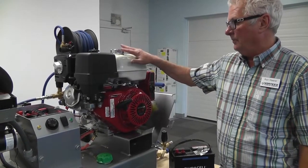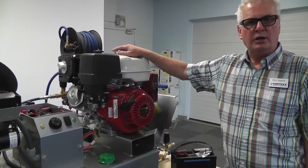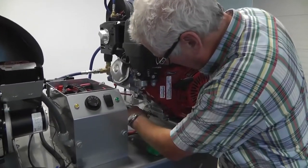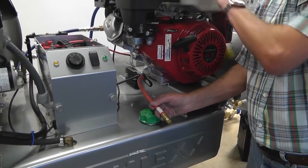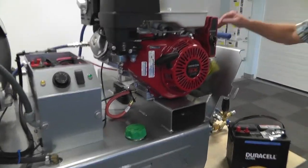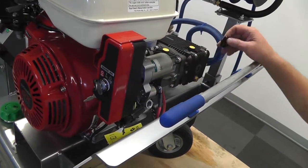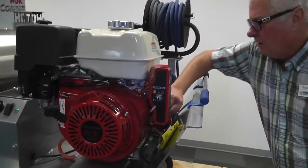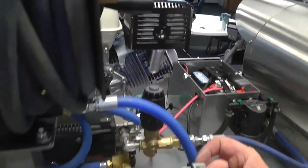My suggestion on the fuel — on the motor and pump — you should change the oil at 50 hours, and then I would change it once a year. I think it's two to five hundred hours per the manual, but you should change it at least once a year. We use OptiOil which will double your life if you want to extend it. We added an oil drain hose here that you can pull out — I'd warm the motor up first, let it get warm, then shut it down, take this cap off here and that will drain the oil out. When you're done put the cap back on, and over here on this side is where your dipstick is at — you add oil right here on this side. Just a small funnel will fill it up. Both the larger and smaller motor take about a quart. On the gray dipstick you'll want to fill it up about three-quarters.